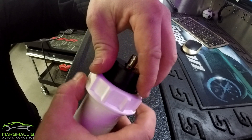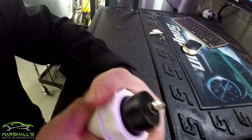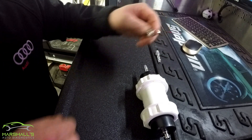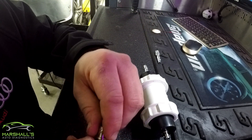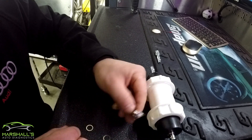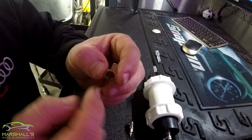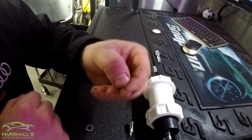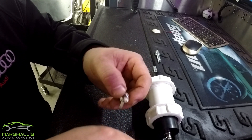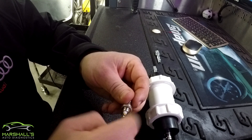Same again, there's just a bucket with an O-ring on that just to seal it. I don't think it's as important for this side to be sealed as well, because that's not the pressure side. Okay — airline end, then BNC. All of these wee BNC connectors from eBay. It's just a BNC connector — there's a handy wee O-ring mount eyelet on it, and I just wrapped my wiring around that, made it nice and tight. So that sat up inside, then that over the top to squash it — threaded it down, it's a 13mm. I just got a socket and screwed it up snug.